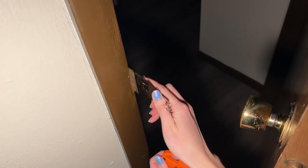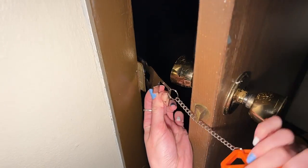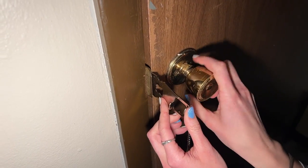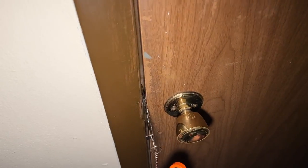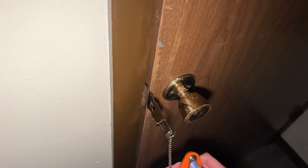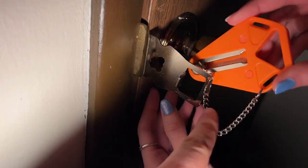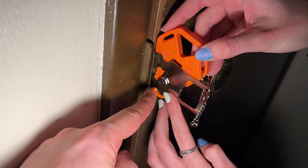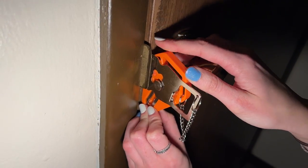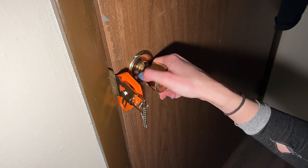You're going to insert this part into the door lock part there inside of the door jamb, and then the next step, step two, is to go ahead and close the door. Now the door is closed and you'll notice that the pin on the inside of the door that engages with this part is through this metal bracket, which holds that in place. Then you're going to take the orange piece and slide back this pin to the back, insert this pin into this spot, slide it down and it'll kind of engage in there. Then go ahead and try to open the door — you can see that the door moves a little bit but it's not moving.